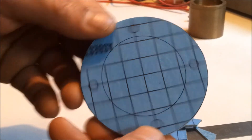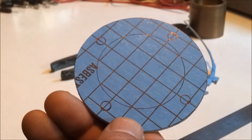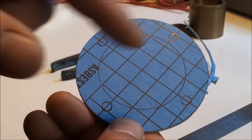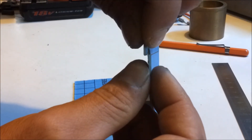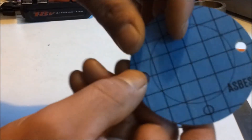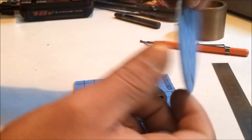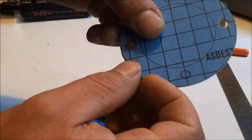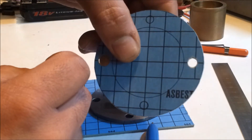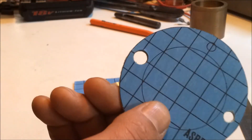There we go — we've got the outer diameter cut and it's looking pretty good. Going ahead now to punch out the bolt holes and then work on the inner diameter. As you can see, the gasket has actually cracked because the hole was too close to the edge — the taper of the punch put too much pressure on that edge and it just sheared away. I've tried drilling it instead and that seems to work pretty well, so I'm going to go with that and cut a whole new one.